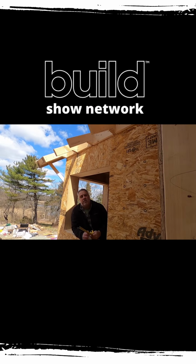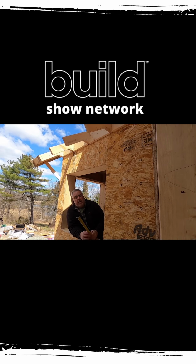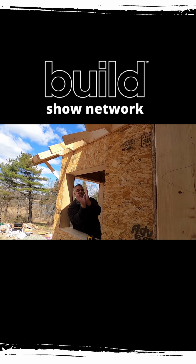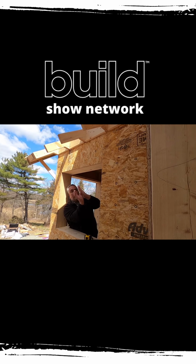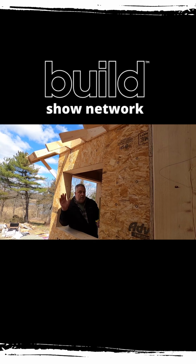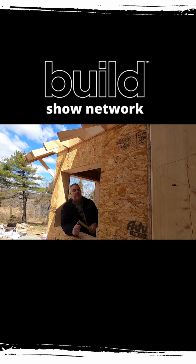The most common reason for using the plumb cut is if I wanted to put gutters out here. Because if I put gutters out there, then I have this vertical face that I can then attach that gutter to. If I have a slope face, it makes it a little awkward to make that gutter connection. So you really have to understand in the design phase what is the look we're going for. Are we looking to put gutters on this house?